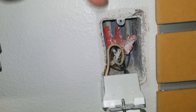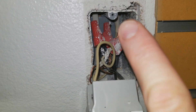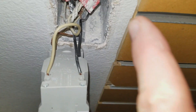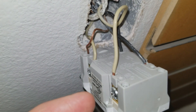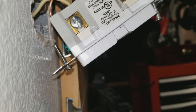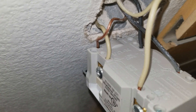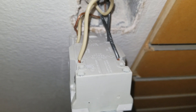These are the lines going out to my other receptacles — they protect all the other receptacles downstream. So if this one trips, none of them work. The lines coming in that are hot, closest to the breaker box, when you test with a multimeter or voltage tester these will register, and they connect into the 'line' portion — white over here and black over there. You just strip the wires, shove them straight in, and tighten the screws on the side. The ground is on the bottom, marked by a greenish teal aqua-colored screw.